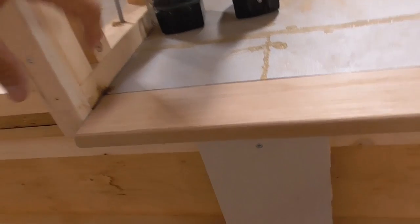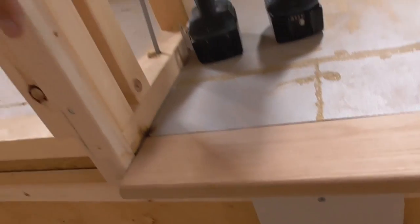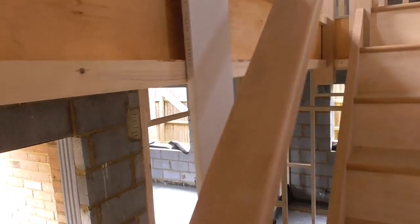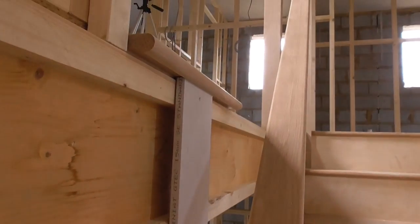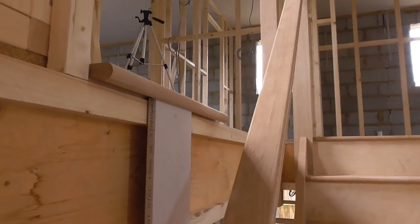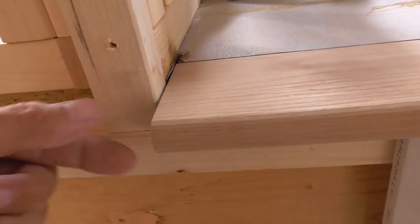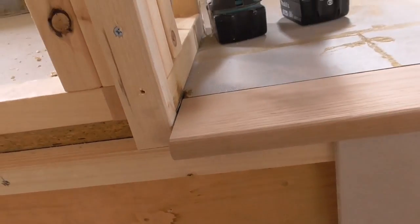When I do the second fix video of these stairs I'll show you how I cut these half newels in so they don't have to go down through the joists — it makes it nice and clean. Again, it's a tiny, not even a video really, just explaining how I've done that detail and how I think it looks really neat and tidy. What I'll do is cut this round here a little bit like a window board and return that moulding to itself. I'll do the same on this side as well.